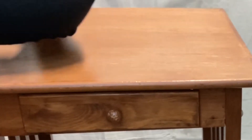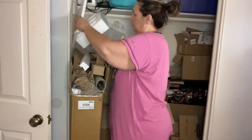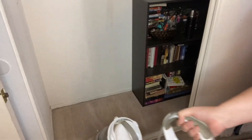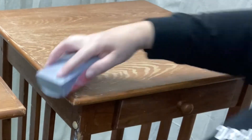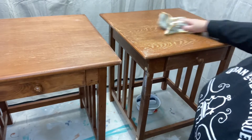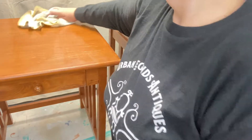First step is a light scuff sanding to the tops and sides of the dresser to help the paint adhere better. I'm going to move all of these shipping boxes into the garage and put my supply shelves into this area of the closet. This nightstand had got water spilled on it because it was a lot rougher and the veneer was lifting a little bit more than on the other one. I'm wiping the dust off from sanding since I plan on stenciling, so I want a nice clean top.